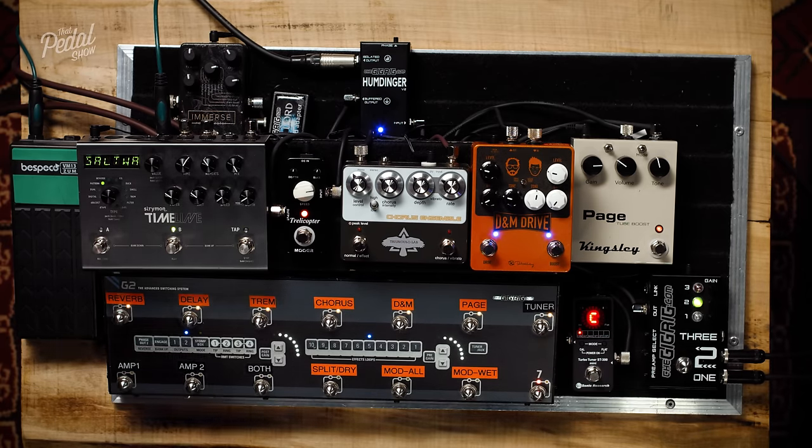It's one of the effects of using an amp with lots and lots of headroom alongside an amp that crunches up a bit earlier. What happens is you lose the front of the note on the amp that crunches, and therefore any subsequent delays that come after it. Although there's no delay in the dry amp at this point, you lose the front of that note. But when it goes into the higher headroom amp, you get the full attack of the note, which is all bright and clean and loud, and then that is delayed. So it still remains bright and clean and loud.